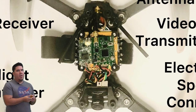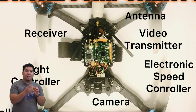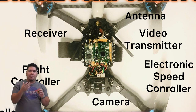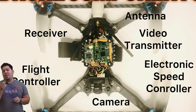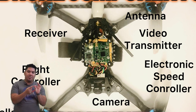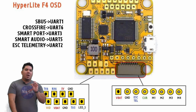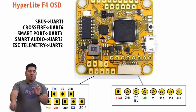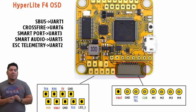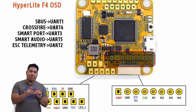There are a lot of other things available on here as well, like a GPS. You can connect a buzzer, and you can connect addressable LED lights that are programmable to do different patterns. Most importantly, what we haven't covered yet is what goes into the harness. The harness typically goes from your electronic speed controller — it will have its own harness that plugs into your flight controller. It also has individual pads where you can direct-solder the wires yourself onto the flight controller.